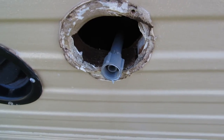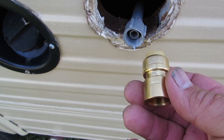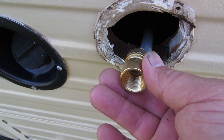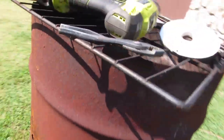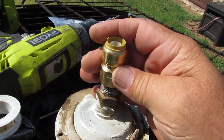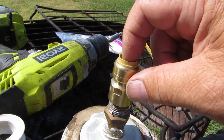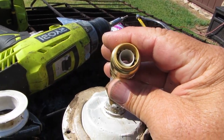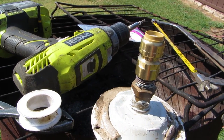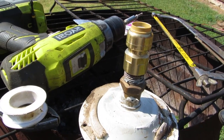I couldn't find a gasket — they don't make them anymore. But they do make what they call a SharkBite connection, which is $8. We're going to cut that hose off with a hacksaw and this just simply pushes on, then threads onto the back of the fitting. We'll use some Teflon tape — the line pushes right into it, seals, and it's done. I've put a new T in mine before because it was broken inside — I just pushed the lines in and it was there, done, and it didn't leak.